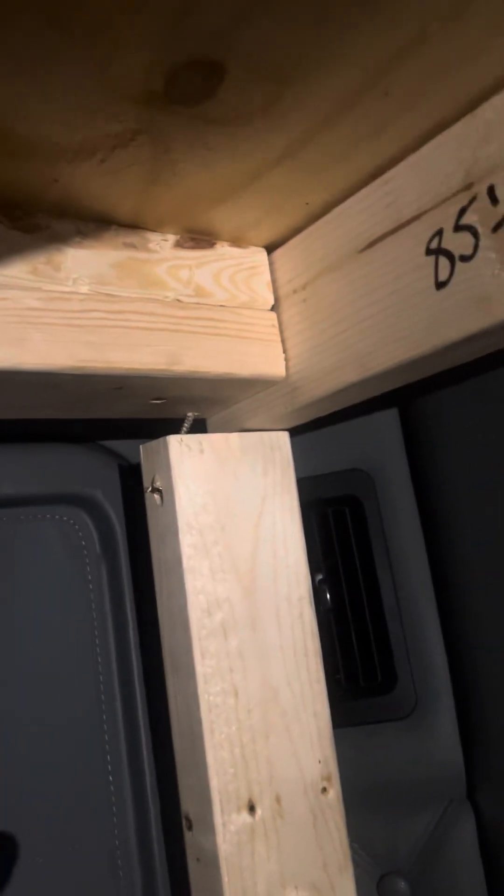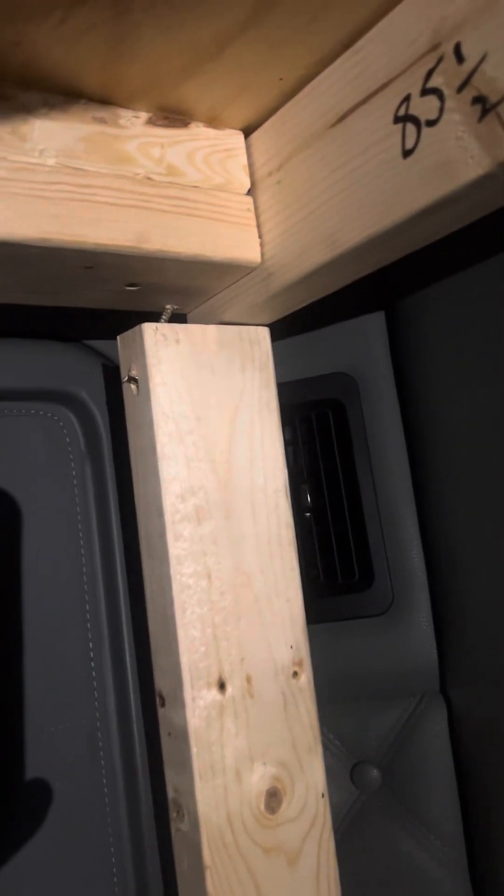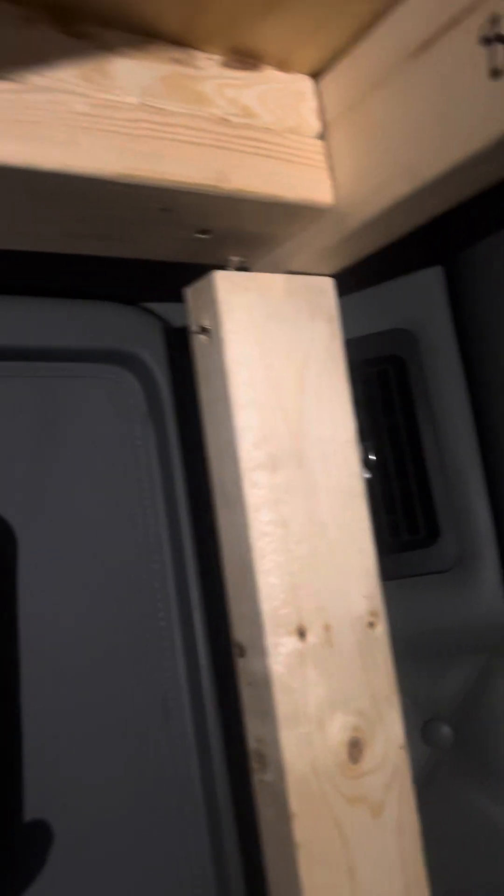I framed it up with two by fours going lengthwise. Because of the dimensions of my escape doors, I put those two by fours sideways and just double-stacked them — that's why you see the lip on that two by four. Now the error that I made is I probably should have notched those two by fours. I now see I actually would have had them coming up on the outside and screwed them into the side.